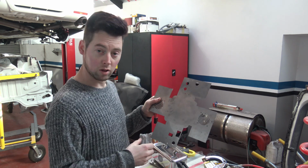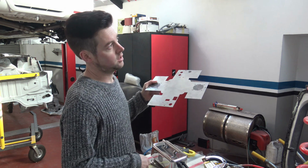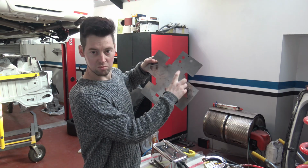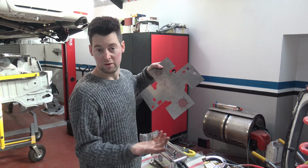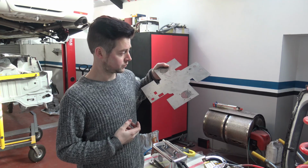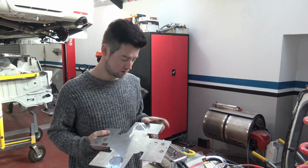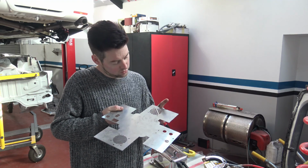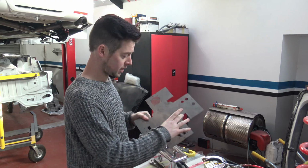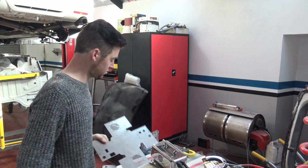This is a small cover that was cut out in the laser machine after I drew it, and fibre laser. So the cover, this is for a smaller transformer out of a microwave, which is no good because I've been testing it with these high cables and all. I'm all greased now, and it wasn't any good. So what I've done is I've designed a bigger cover. So this other cover came out here, another 100mm, and that's where you get this box.